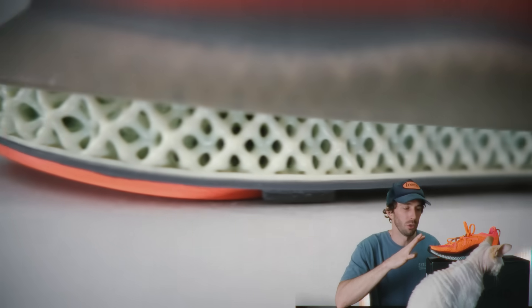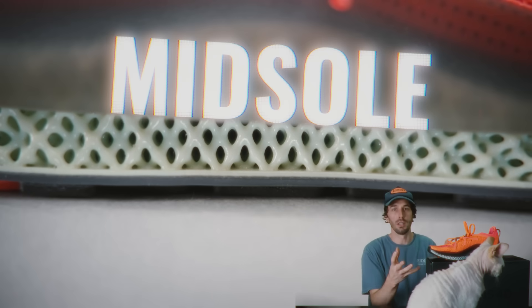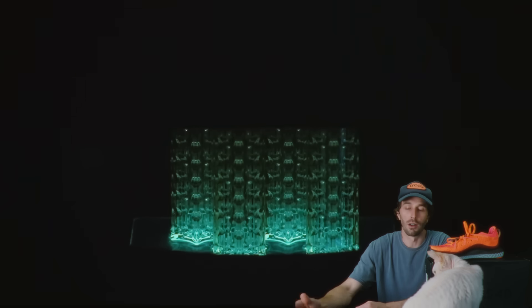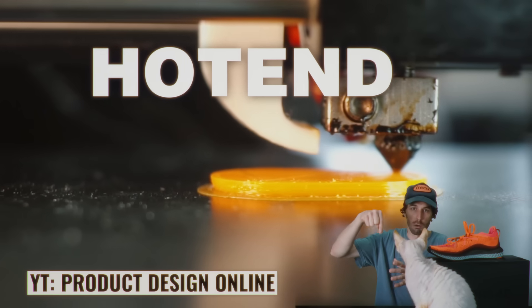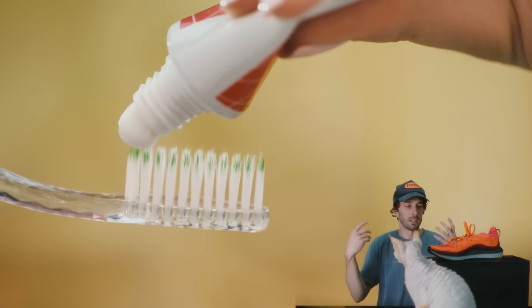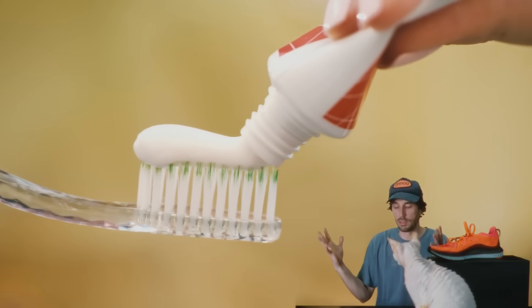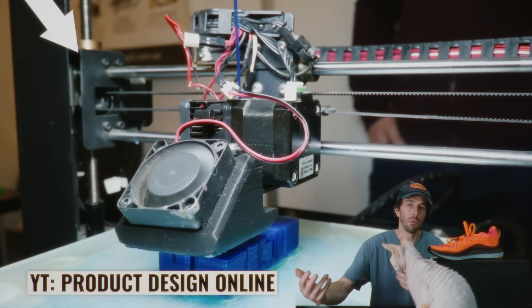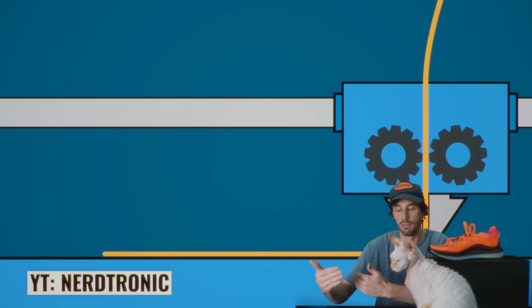On to the most interesting part of this shoe: the 3D printed midsole. So how is this made? They create this really unique lattice structure with a 3D printing process called digital light synthesis. That's really different from regular 3D printing — where it starts with a flatbed, then a heated head liquefies and extrudes material layer by layer, slowly building up the structure. It's like squeezing toothpaste, or easy cheese on a cracker building up a little honeycomb. But the issue with that kind of 3D printing is it can be weak because each layer cures individually, one at a time.